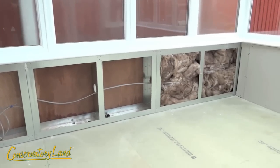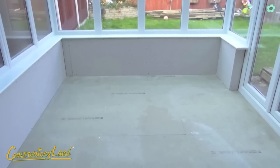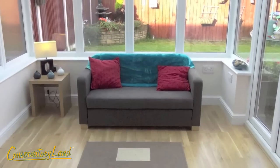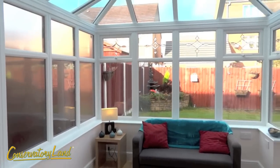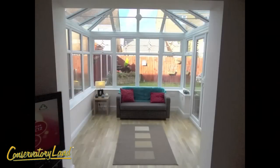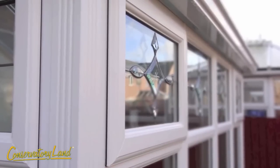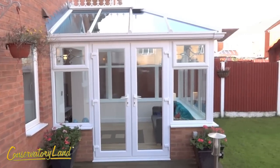All modular walls incorporate utility ports for easy installation of cables and pipes. Suitable insulation is inserted before finishing with plasterboard and skimming. An internal brick finish is also available as an option. The installation is finished and is completely indistinguishable from a conventional build.